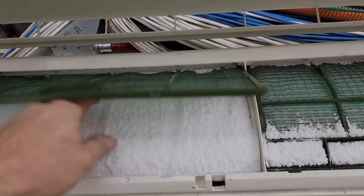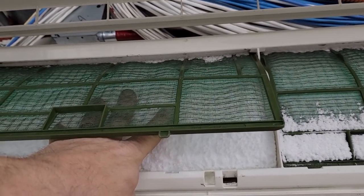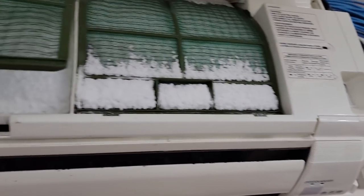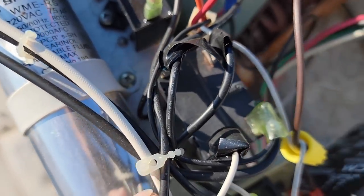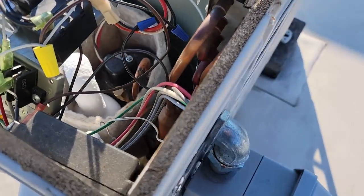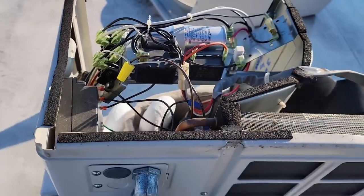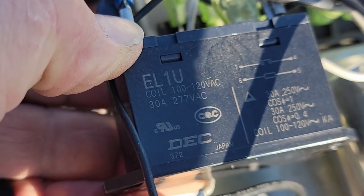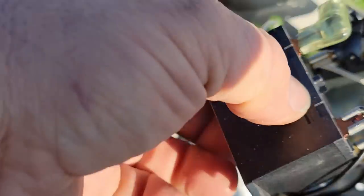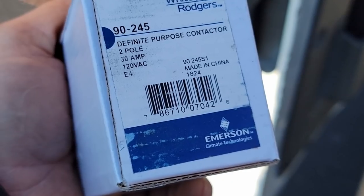I've got a recall here. He's had it off for a while, so since it's really cold in there — ice, go figure — I bet this thing's sticking. It's got one of those cheap little relays I pointed out the other day. Let's go look and see if it's running. Here's the generic little relay. I bet it's a DC relay or something. Well, if that's just 24 volts — we're going to rip that out and put a regular contactor in there — 120 volt coil. It'll be a lot more reliable than this thing.